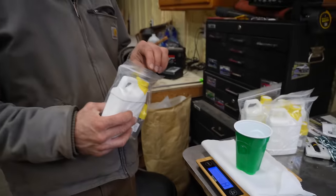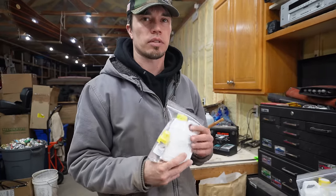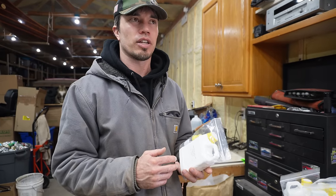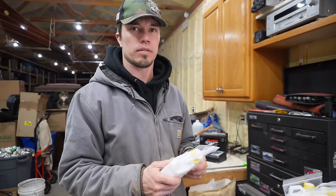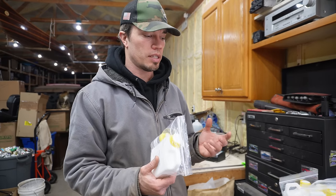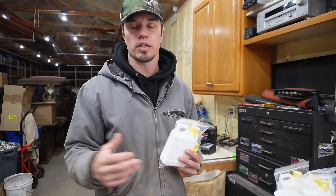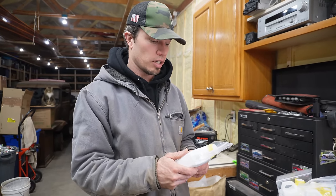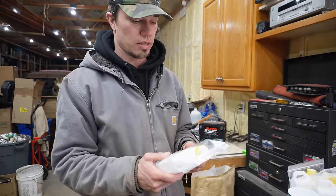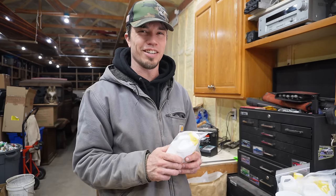We have a scale set up. We bought a gallon since we have a whole bunch of panels to do. It's expensive and tricky because it gels in four hours and cures in about 24 hours, so you can't reuse it once mixed. We don't want to waste a bunch, but since it has a four-hour pot life, we can mix a little more on top of it. We're planning to do four panels today and may end up wasting some. I couldn't find any cleanup information — it's a silicone rubber-based product — so the paintbrush is probably one and done.